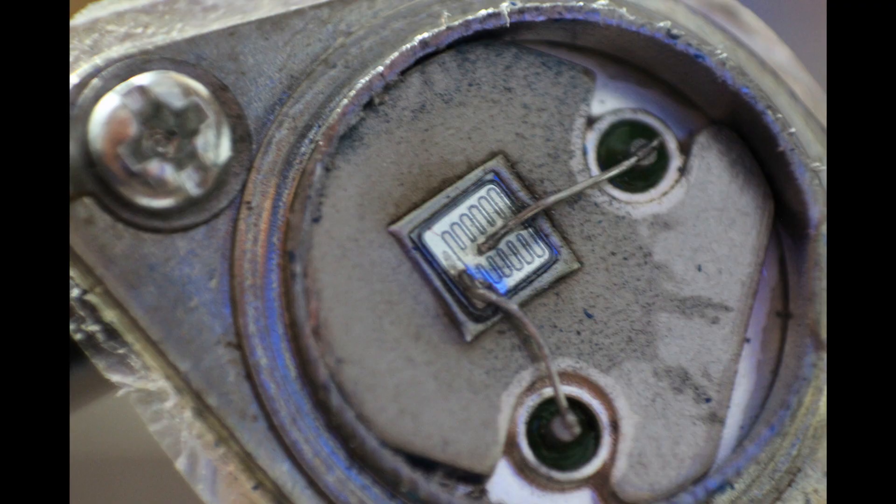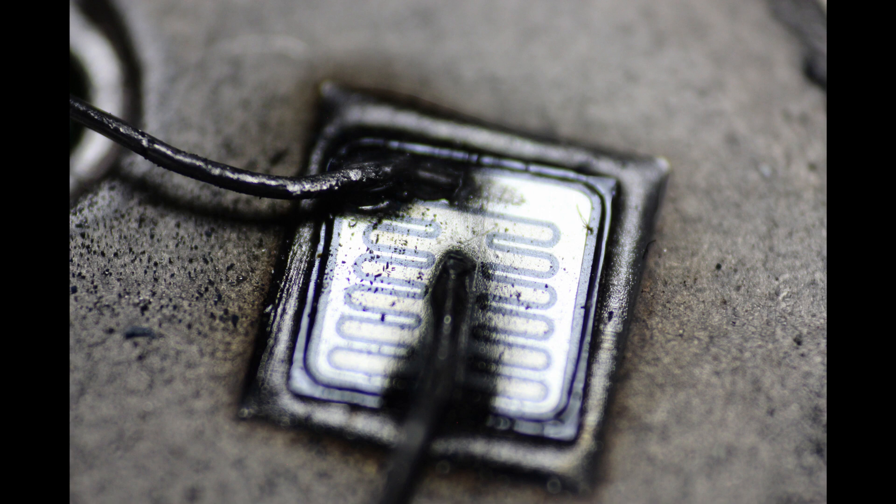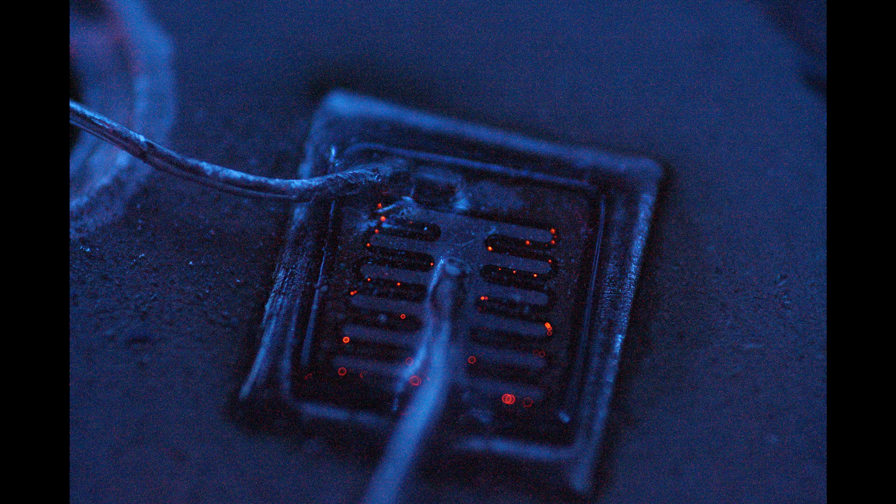Enough sawing — let's zoom in, turn off the lights, and increase the exposure time. Well, I'll be damned. Believe it or not, it actually took 20 volts to break down the emitter-base junction of this ancient transistor. Unfortunately I could not see any glow with my own eyes, but there you have it — some light is being emitted. As for why the light emissions seem localized, I have no idea.